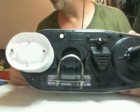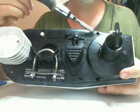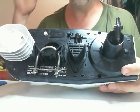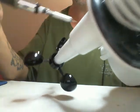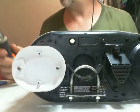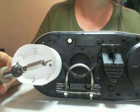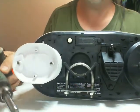To start this project, we're going to have to remove the wind vane and remove the four screws that hold the cover on the unit. You do not need to remove the anemometer cups, because this sensor is actually screwed into the top of the unit, and you don't need to remove the bottom piece either. For tools, you're going to need the Allen key that came with the Davis, and a Phillips screwdriver to take the screws out.